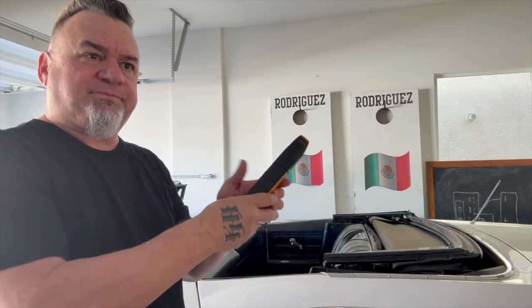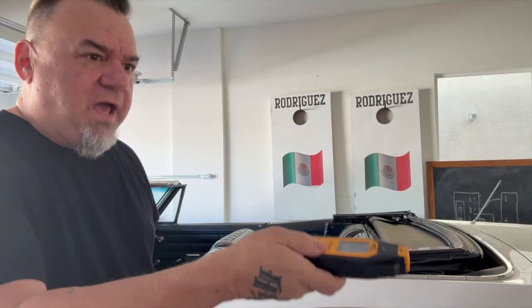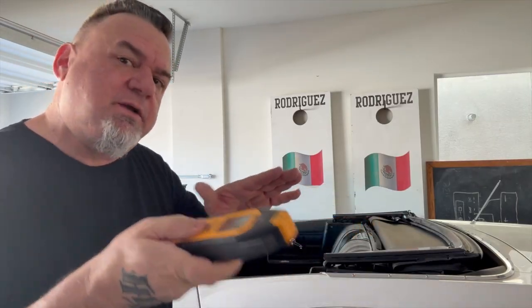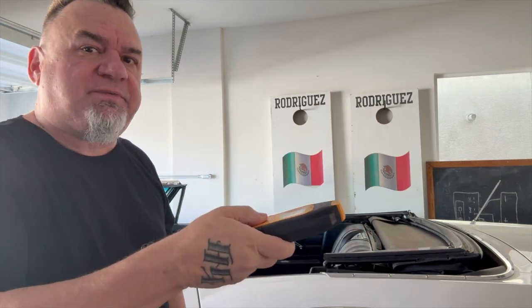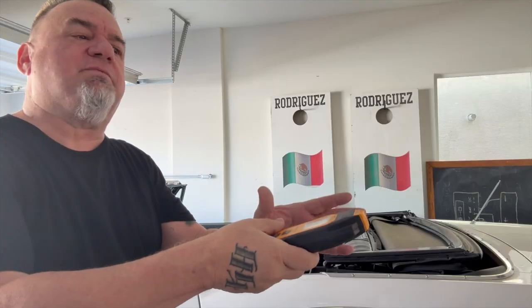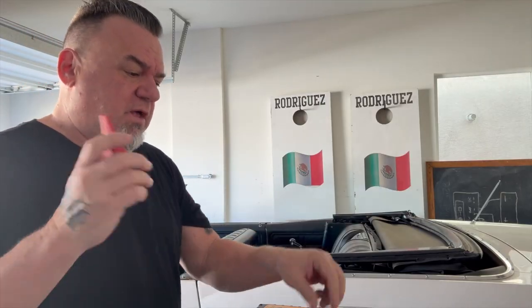Then you take your tracer and you go along your circuit, and you could find your circuit at each plug. So you could see where that hot might be going, or that neutral — maybe you're going around and that neutral just stops. Like, there it is, there's my problem. So that's what's great about this — a lot of different functions. And I really like this: if you've torn off your wiring at your socket or your switch, clip on your alligator clips and it'll get you back home. One wire went up to the light, traced it out; one went down to the plug, traced it out. All this stuff is invaluable.